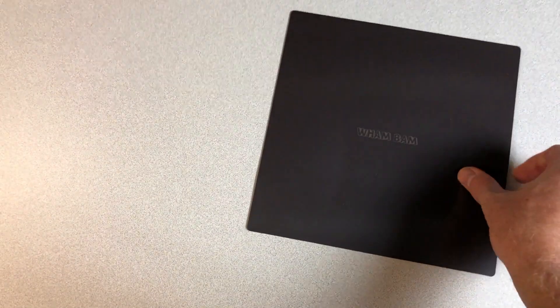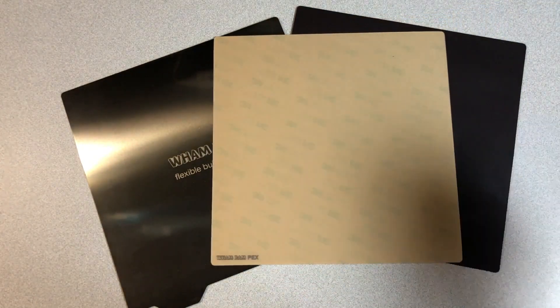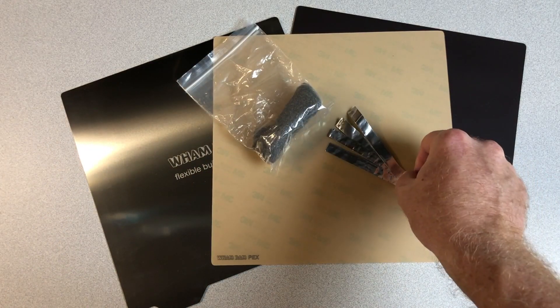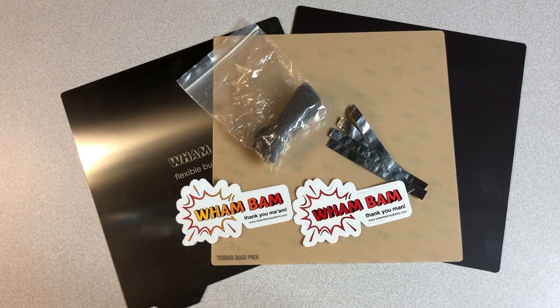So, what all comes in the box? Well, let's find out. The product has a high-strength magnetic sheet that can withstand bed temperatures up to 130 degrees C without losing its magnetism, so you can print materials such as ABS which require really hot print surfaces. It also has a nicely polished spring steel sheet and a PEX sticker sheet — it's kind of like a PEI sticker in that you peel and stick it on the spring steel sheet, but it's a different chemical formulation. For example, you can print PETG on it, and the PETG doesn't fuse to it the way it does with PEI. When the bed cools down, usually the prints will just release, but if they don't, you just remove the sheet and flex it to get the parts to let go. There's also a little bit of steel wool for PEX surface preparation, shims so you can compensate if the bed isn't completely flat, and stickers. One thing I've noticed about the 3D printing community — we loves ourselves some stickers.